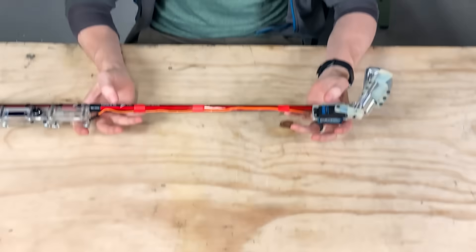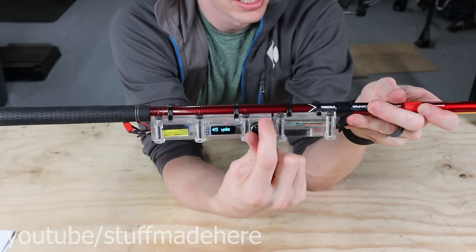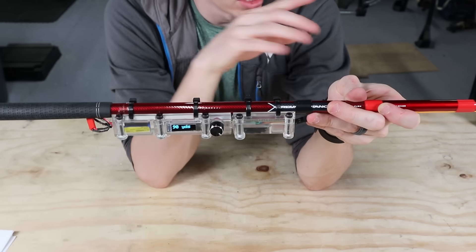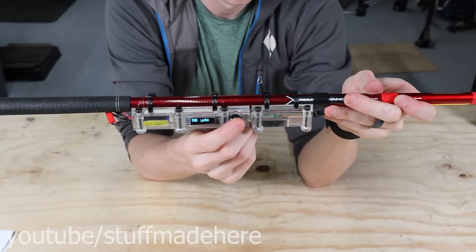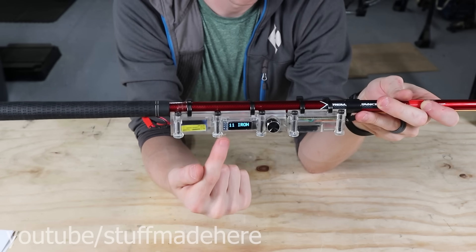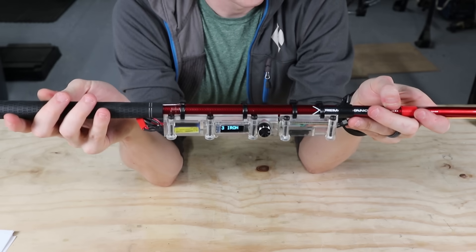That's pretty much all the interesting things about this club. I did pack all the electronics into a way-too-small enclosure. This thing has two main operating modes: there's distance select, where I enter the distance I would like the ball to go — whenever it's in this mode, it's continuously listening to the IMU and looking for a swing, and will start adjusting the face of the club to wherever it thinks it needs to be so the ball will go the correct distance. The other mode is basically acting like a normal club, where I can select whatever club I want. It does go up to 11 — I mean, it has to, right? I guess that would be a sand wedge.